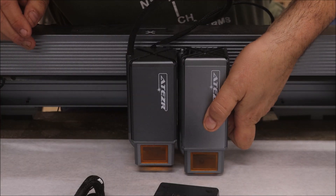Holy moly, look at the size difference in this sucker. Before you jump up saying you've got to have it, know that you need to know what you need for your business. If you're just needing to engrave stuff, you don't need a V35. You need something more like a 5 or 10 watt laser. This laser can cut through a 2x4. An engrave and a cut test are the best ways to figure out what you need on what material, so that's what we're going to do today — a lot of cutting and engraving on a lot of different materials. We're going to start off with some 3mm plywood.